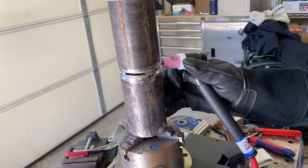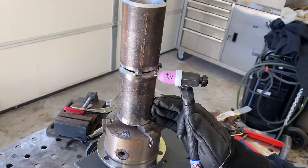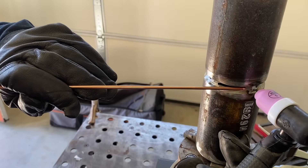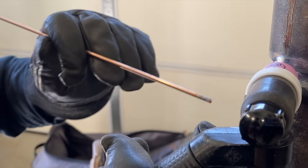Another shortcut is we've got it set up on a positioner here. A lot of it is run without the positioner running, but sometimes for arc shots it makes it a lot easier to run the positioner so the camera can stay focused on the arc. ER-70S6 filler makes a big difference on a joint like this — it seems to flow into that root a whole lot better than S2. If you have the choice for open roots, I highly suggest going with S6. A 1/8 gap, a 1/8 rod, and about 100 amps seem to do the job really nicely.